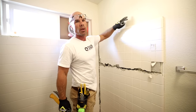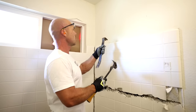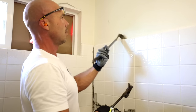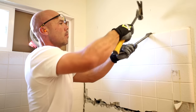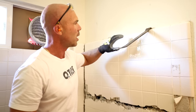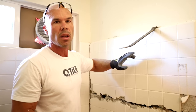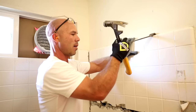We marked where the studs were - those are what you want to pry off of. I'm just going to take my bar against the stud and start prying. You see how it just wiggled loose? This is tile, float, and drywall - I'm trying to take it all off down to the studs. You may have Durock or cement board and just tile, but same principle: you want to get behind the wall board to the stud so you can pry off of it.